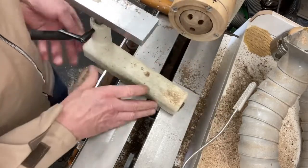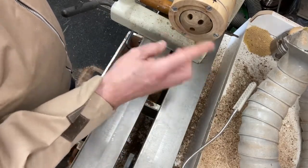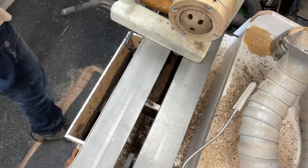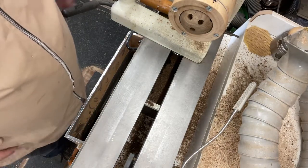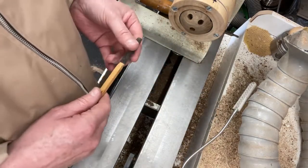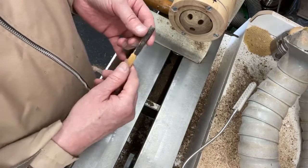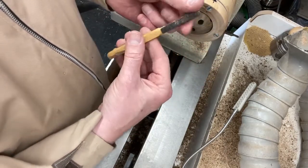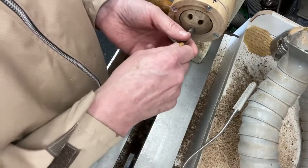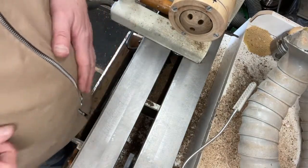Stop the lathe, move this out of the way. Something John Lyles mentioned when doing these - on a piece of paper just mark off the hole you've just done. A few more to go but that's basically the process, it's just repetitive now. Just to assist in moving the ball once I've released the screws - the ball is still held quite tight - I've got a stick with velcro on the end that I use for sanding. I can then move the ball around as necessary just to get that fine adjustment.